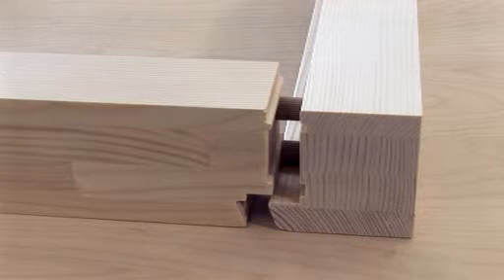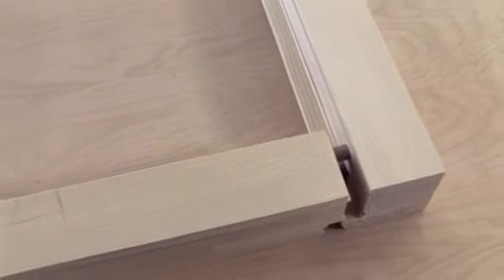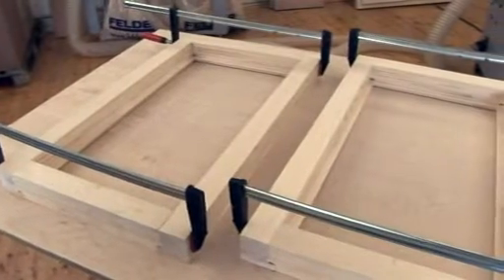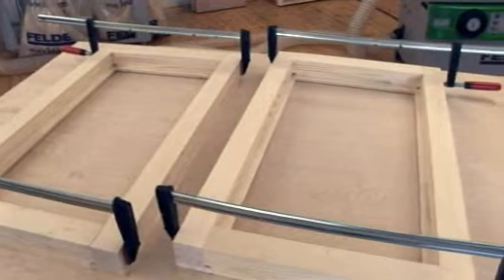All of the profiles on the inner side of the windows are now completed and these can now be glued. The window is even more stable thanks to dowel connections between the profiles. Normal C clamps will suffice in keeping the timber compressed firmly together — there is no need to invest in a gluing press set.